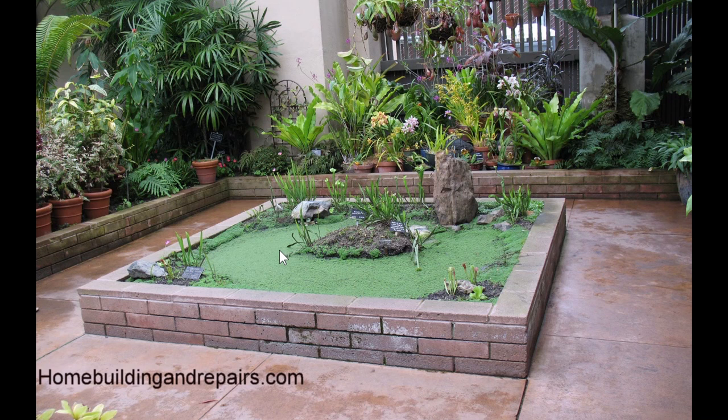Here's something that has a lot of water in it and looks like they used some type of bricks or blocks, and you can see where the water is coming through. Over time this is going to weaken the structure — it could actually come apart. The mortar that's in between the blocks will weaken before the blocks actually come apart. I've seen water practically disintegrate products made out of cement and sand blocks — not a brick really, but the blocks. The water just tears the mortar up.